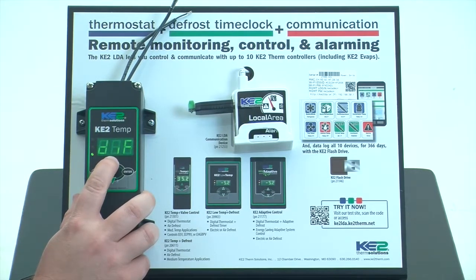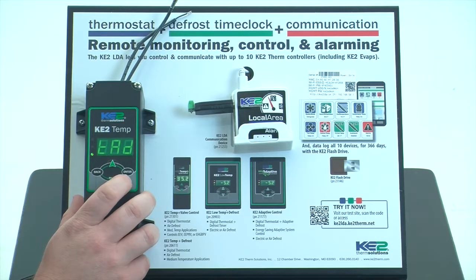Use the up arrow to navigate to TAD, or temperature alarm delay. This is the number of minutes after the controller has exceeded either the high temperature alarm offset or the low temperature alarm offset at which the controller will go into alarm mode.